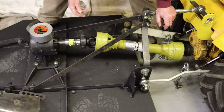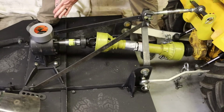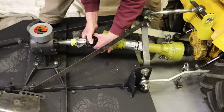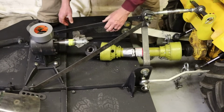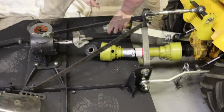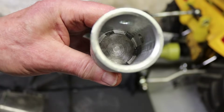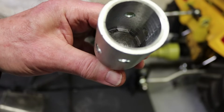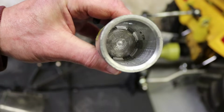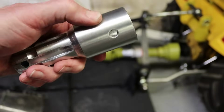All right. So now, last thing I need to do is a shear pin through here. And there's a hole through the shaft here. All right, so I put the adapter back in the mill and bored it all the way down to the bottom. There was almost 1/4 of an inch still of splines left at the bottom. So got that all removed. That gives me a little more engagement on the shaft, and maybe we'll get one of these holes to line up with the existing hole.